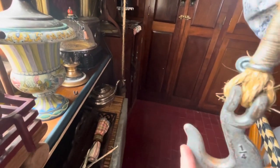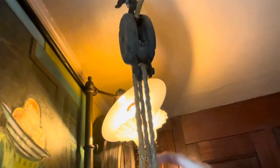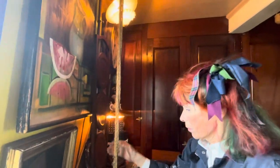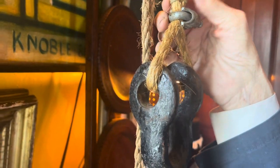And then I'll show you over here with these. See, this is the block. That's called a block. So it has the pieces coming through, and the weight here, the counterweight is here. This is the weight and this is the counterweight that keeps everything straight. If you didn't have this counterweight on this little pulley system, it would splay out and get all cockeyed, and the line could fall off. Here you can see up close where I did the same thing — using a cable clamp and the whipping to keep this from fraying.